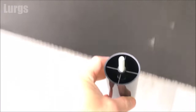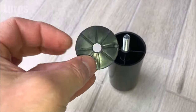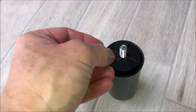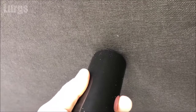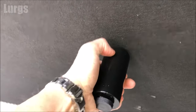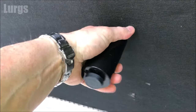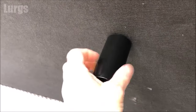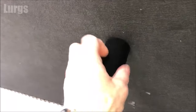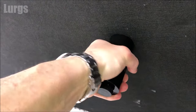This is a three/four seater sofa and there are two support struts, so we need to find the two holes. Let's get this one in first — make sure you put the plastic gripper washer on with the indentations facing upwards so it's got a bit of grip. Push that into the hole you've made and then turn it clockwise, just keep screwing it so it's nice and tight — get it as tight as you can with your hand. The leg at the bottom unscrews to come down to the floor to give it extra support.